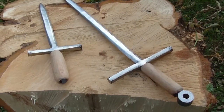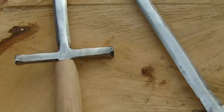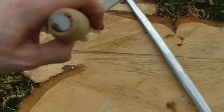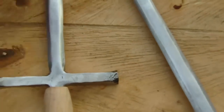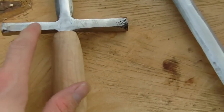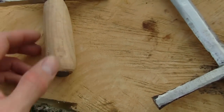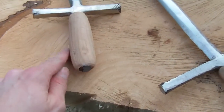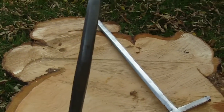Here are my forged blades. This is the first one — the dagger I put together. It's built from rebar; I forged it in my propane bottle forge. It's 5/8 rebar and I've just flattened it out, hammered on an edge, and then ground an edge on after. I welded on these pieces of rebar out the side here as a guard. I put an apple handle on here — this piece of apple I just cut out of a log, sliced it around with a sawzall, and rounded it on a belt sander. So this is a cool little zombie killing dagger.